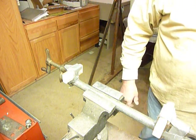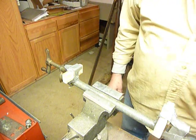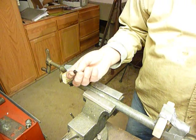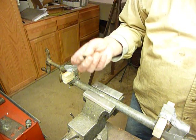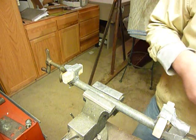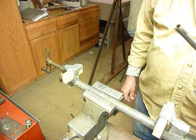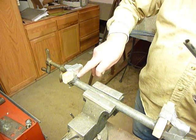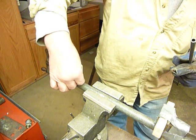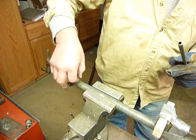I've got another little tip here that I came up with. The instructions talk about pressing the end of the push rod into the push rod itself, but I don't have a press that's big enough. So I got some old woodworking tools out — a bar clamp or pipe clamp — and drilled a little hole in a piece of scrap aluminum that the push rod will fit right inside of. I backed it up with wood, as you can see.